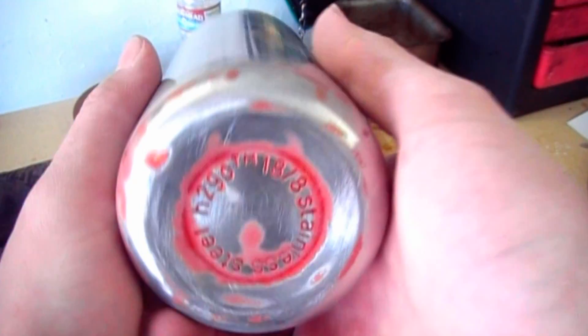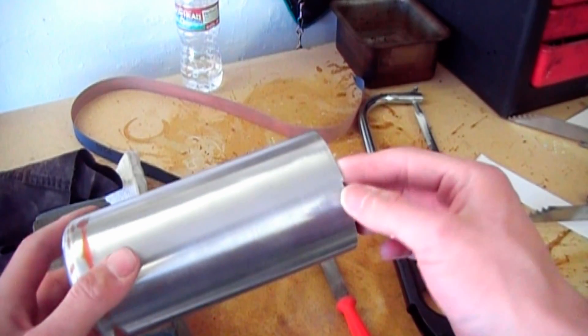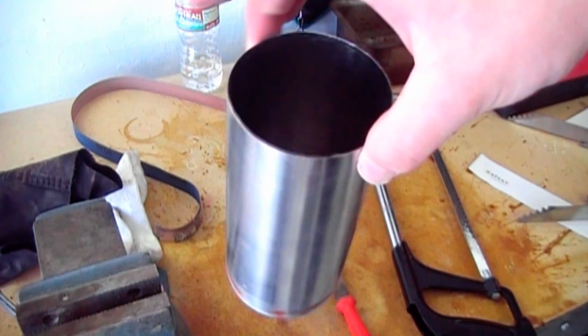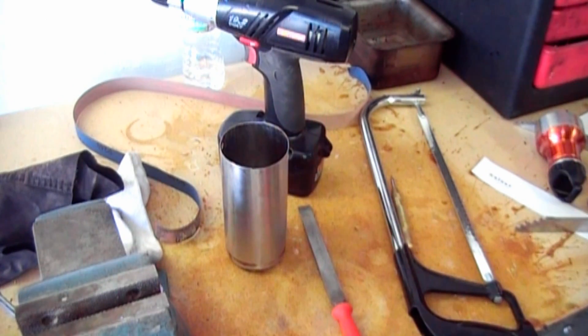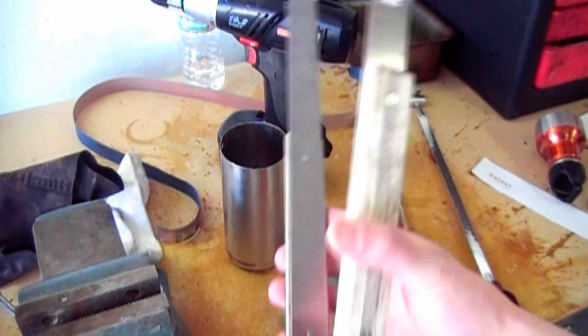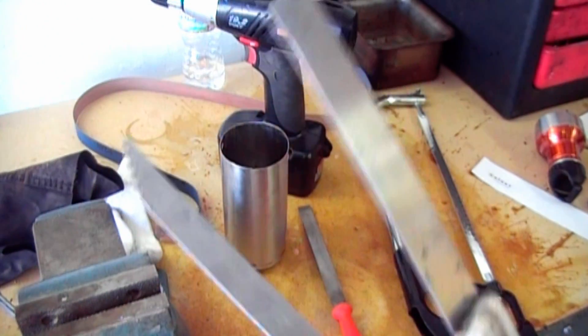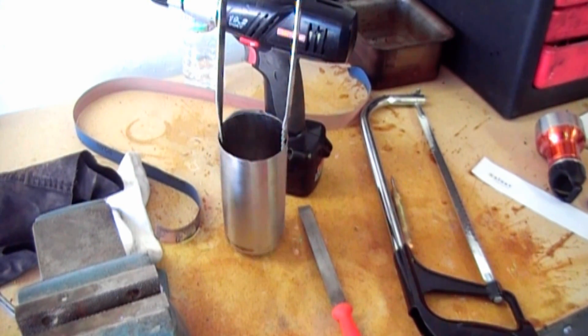I'm done cutting the top off of this stainless steel bottle, revealing the unfortunate reality that these are not as substantially made as they seem. I'm going to be drilling two holes — one near the top and another one on the other side — for my lifter tongs. These barbecue tongs are going to be my crucible tongs; I'm going to affix some pins on the end of each tip that protrude outward so I can engage those holes and lift my crucible out.